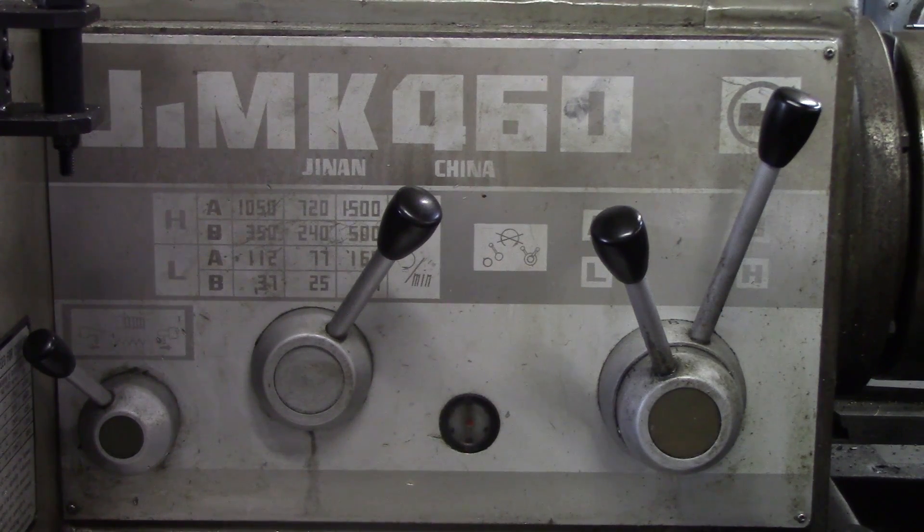We're now moving on to power feeding. I would highly suggest getting to know your lathe first — moving it around, changing the spindle speeds, turning a few things — and when you feel comfortable, then you can start the power feed. Be sure you know what you're doing because it can be very dangerous. The machine does not care whether you want to stop; it only knows if that handle is engaged and it will keep going no matter what. So be sure you know what you're doing on a manual lathe. If you have any questions, please let us know.